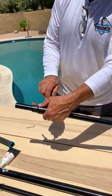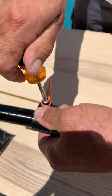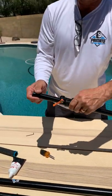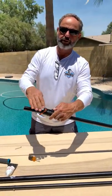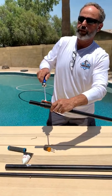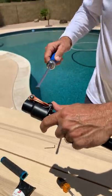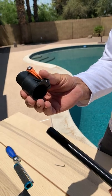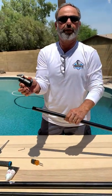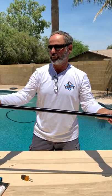Now to remove this lever lock entirely, I'm loosening the two screws on the lever lock housing. There's a built-up portion here on what we call tube number two, the middle tube. You're just going to expand this lever lock housing slightly and push it right off the second tube. You would reverse this process to replace the lever lock or replace the number one or number two, the middle tube.